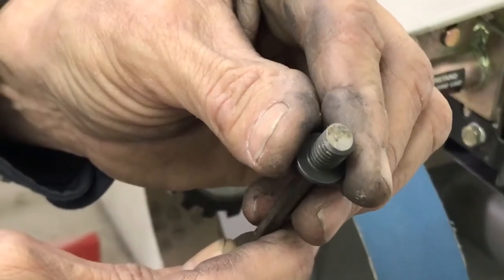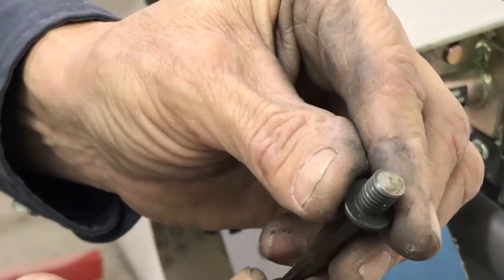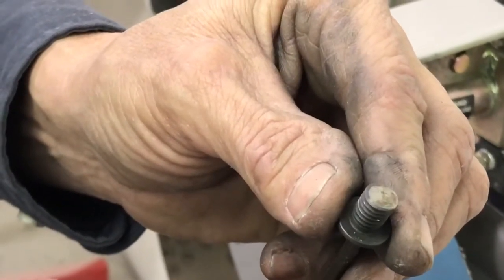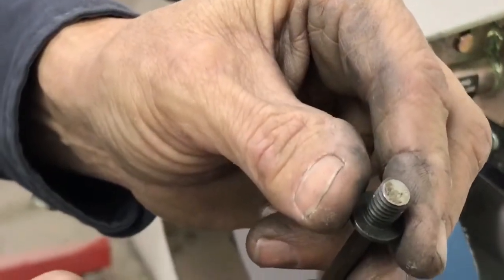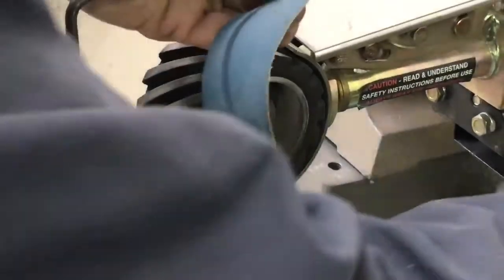This is Skip Banta with Tar Heel Parts, here to show you how versatile the multi-tool is. Today we have a bolt which I just cut off to shorten it up a little bit — it's a little socket head bolt. All I'm going to do is come along with 120 grit after it's been cut off, to dress up the cut, and then follow up with 220 trizact. This is a 120 grit zirconium belt.